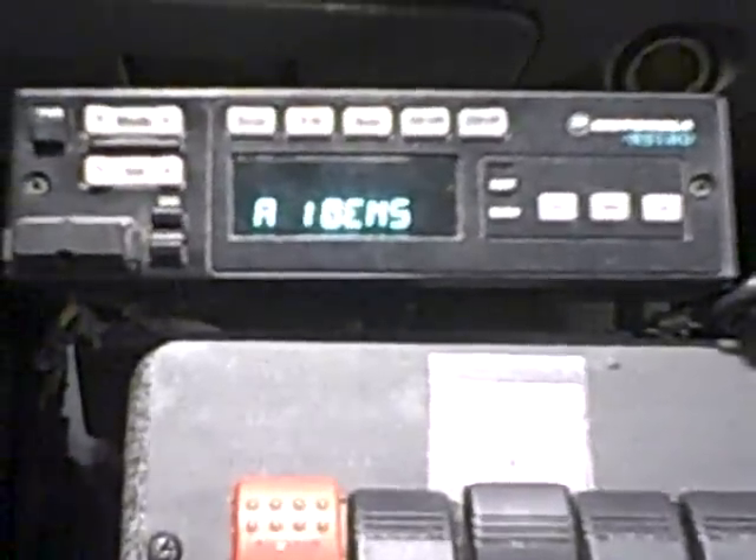Now we're going to show you how to operate the vehicle repeater. You select the talk group you're going to be operating on — for training purposes we're using 10 EMS. Then find the repeater switch, usually located on the rocker panel, labeled 'repeater,' and turn it on. These rocker switches will illuminate green. Some on the older ambulances are red rocker switches and will illuminate red. The red ones are usually located on the kick panel directly to the right of your leg. Now that the repeater is on, to place the portable into operation: you're on 10 EMS, turn your radio over to the side, select the up button, press it once, turn it over, and you're on repeater. It doesn't matter what frequency you're originally on — as long as you switch over to Zone B, any talk group will be repeater and you'll be up and running.